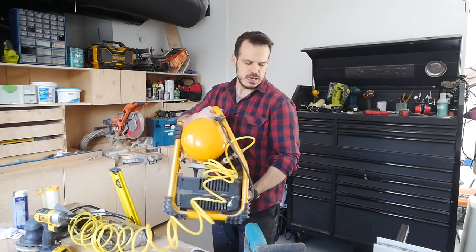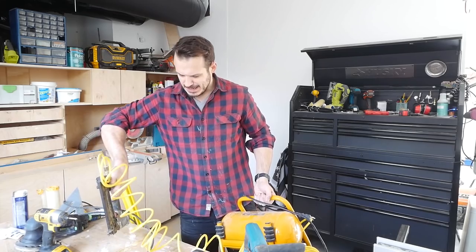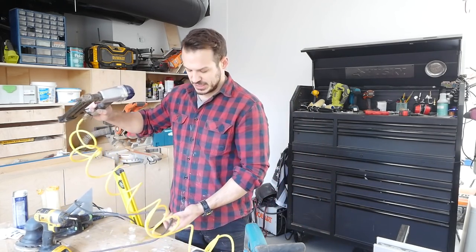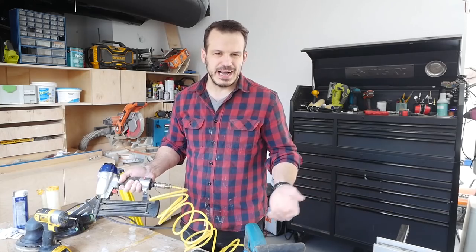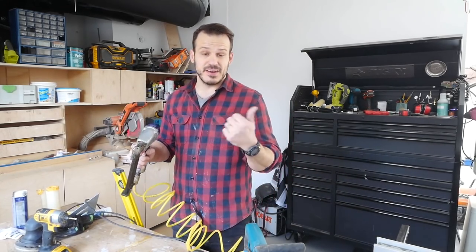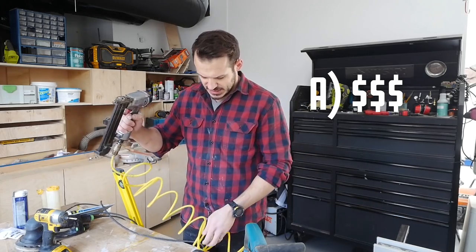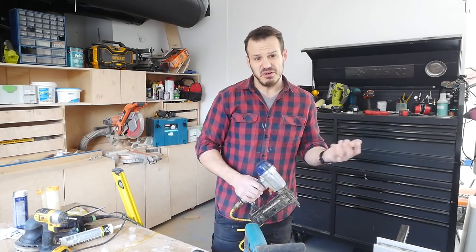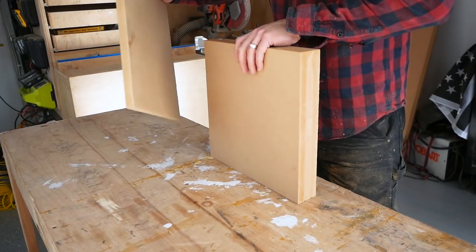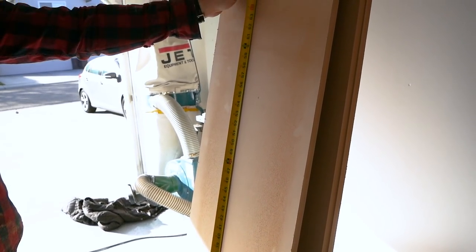When figuring out which materials I wanted to use for the project, a couple ideas hit the mind. Finish grade maple or birch plywood, three-quarter inch stuff — I thought it would be great, it paints very well. The only reason I didn't go with it is the majority of mudroom sections are always made up of that really high-density MDF. And because the place really gets trashed and it's gonna get painted white, I didn't want to spend money on expensive solid stock or tinker with edge banding exposed plywood on the sides. The easiest solution was just to use the classic 4x8 sheet of MDF — about 30 bucks a sheet at my local store. I used a sheet and a half, so it was really budget-friendly.